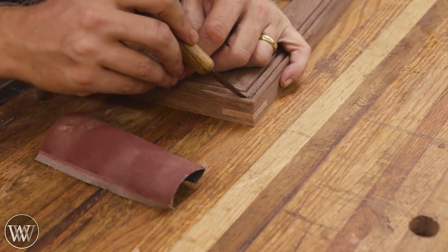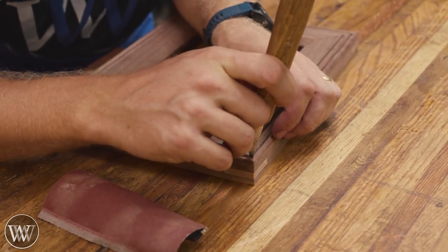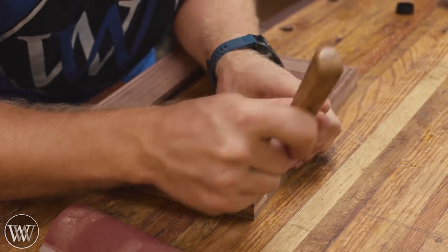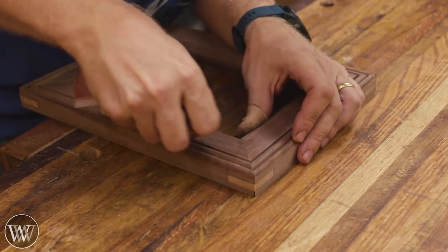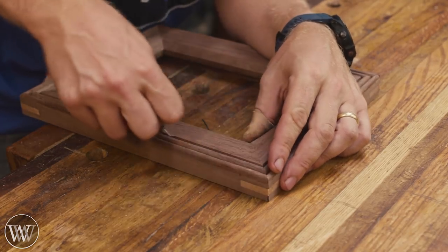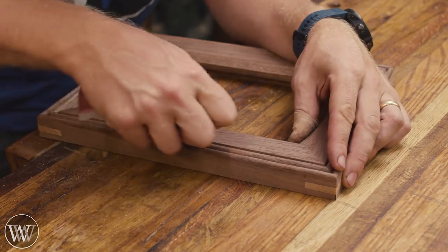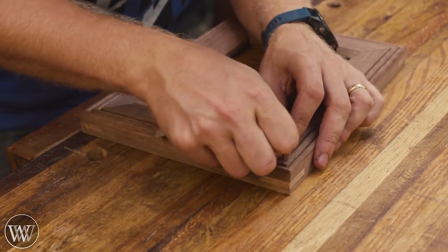The last thing I want to do is detail it out. Because I have these grooves from the rabbets, I want to clean them out with a knife and a small piece of sandpaper, bringing everything into that final smoothness I want for the finish. Don't diss the sandpaper — it's really useful, especially in little things like this where you can bend it over and get into corners. Gives you a really nice surface.